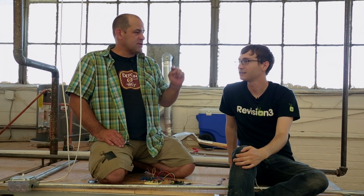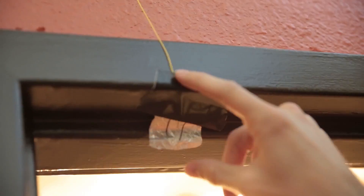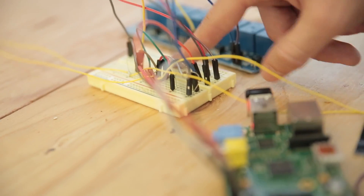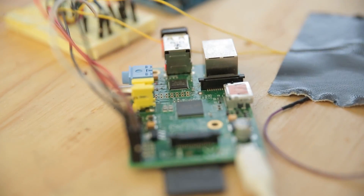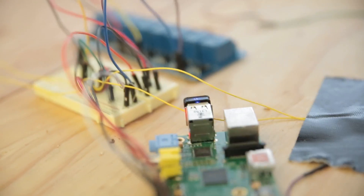Let's start with the sensor, the code, and the website — one after another. Here are the ghetto aluminum foil and duct tape with some wire sensors. There's one sensor on the inner door jamb and one on the door. When the door closes, it closes the contact and the Raspberry Pi knows the button is closed. The door sensor wires run to a breadboard wired up with resistors so the Raspberry Pi knows when the connection is closed and which door it's closed on.